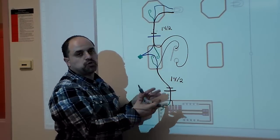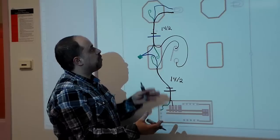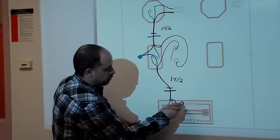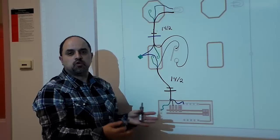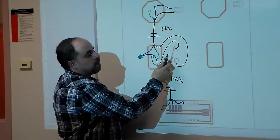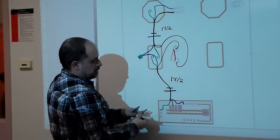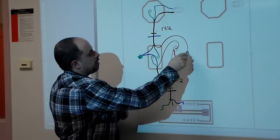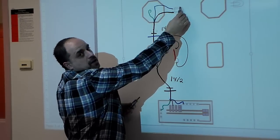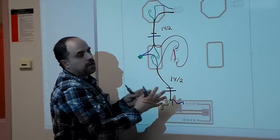There are many ways of wiring up a lighting circuit. We're going to show you one way first, and then in the second part of the lab I'll show you another way where power starts at the light. The way the current runs, it's in a loop system. Power goes in from the breaker on the black wire, comes to the switch, and if the switch is closed, current flows into the other black wire, comes into the light bulb, flows through the filament, gets white hot, returns on the neutral, and back to the neutral bar — and the light will come on.